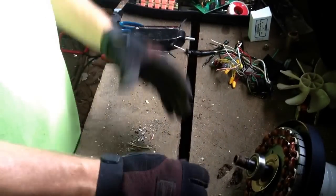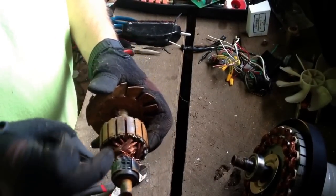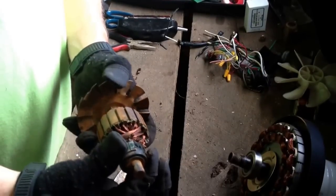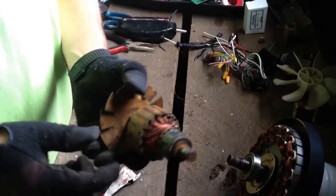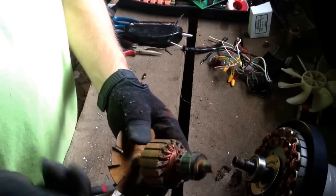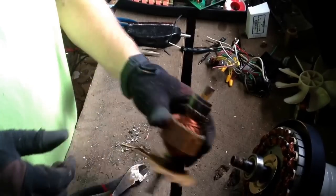That's a nice piece of copper right there — it just broke loose from that plastic. Lay those over to the side. You can see how that exposes it: these plates here have teeth on the back side of them, and when they put them down in there it's a liquid encapsulation, and that's what holds it in. Once you get those clips loose, just bend your wire down and pull it back to the side. That's how you can harvest that out — easy way, no big bunch of tools needed — and that's going to give you 100% yield of your copper out of a copper-bearing motor.